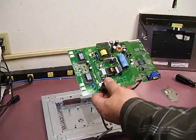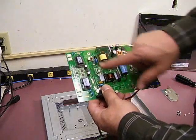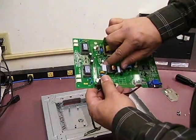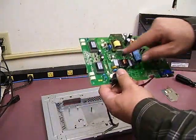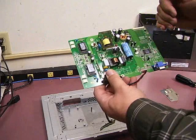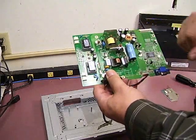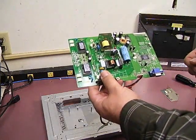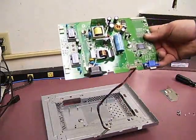Here's the control board — this is the board we'll be doing the repair work on. We will be repairing the capacitors: two on the backlight inverter, the rest in the power supply. If you notice, there are a couple of capacitors that have hot melt glue on them to hold them on. Once you replace those capacitors, it's not necessary to put hot melt glue back on. That was the manufacturer's way to see if anybody had changed the board — if the hot melt glue was missing, they knew someone had done repair work on it. Let's take it over to the soldering iron station and replace our capacitors. That'll be in the next video.